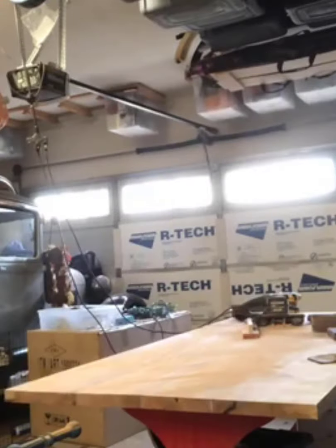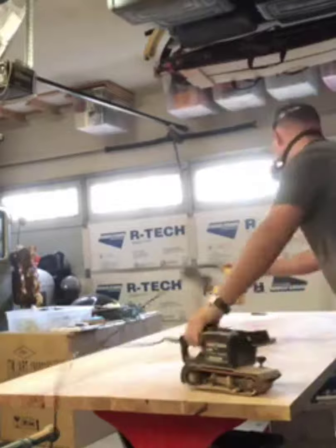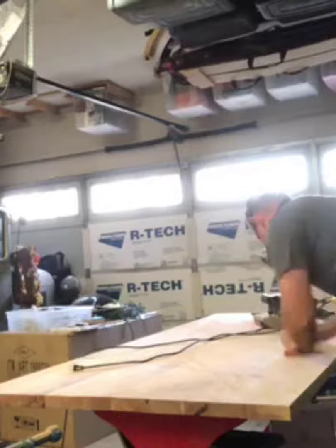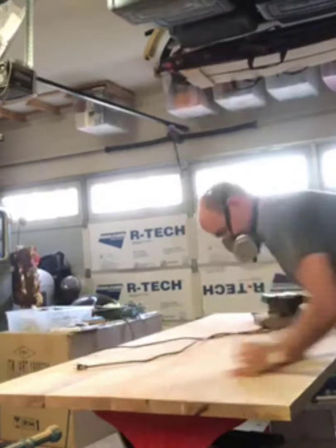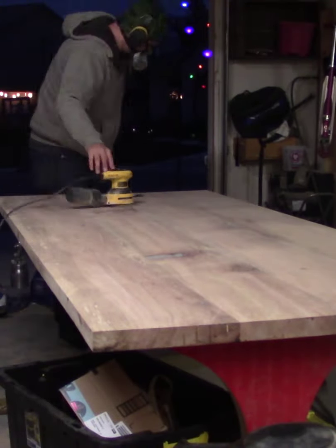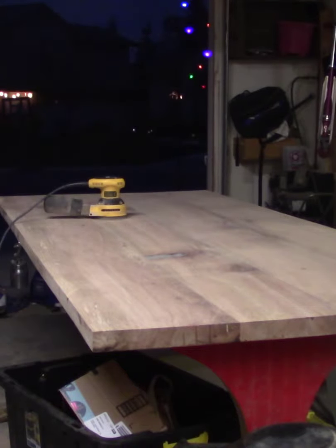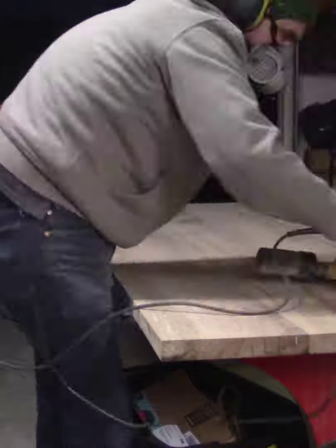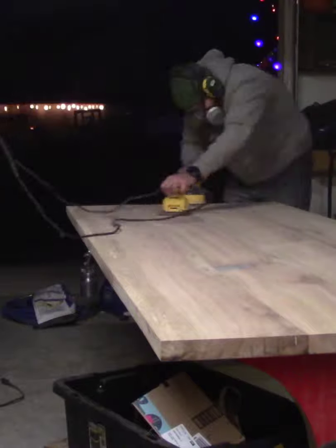While waiting for the legs, I started sanding. The top needed a lot of sanding work. I started with a belt sander, which put a lot of ripples in the top. So I went back and used the auto body and fender classic of cross-sanding with really coarse sandpaper. Then I went into palm sanding with 80 grit, then 100, 120. I got really bored sanding with one palm sander, and I have two, so I broke out the second one and did some dual action — not sure it was really more efficient, but it felt a lot more efficient.